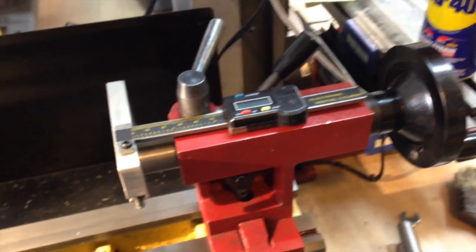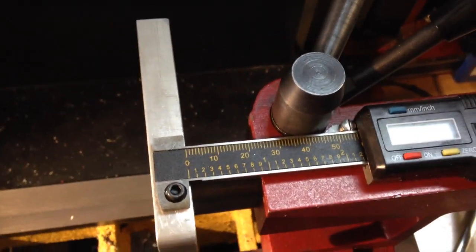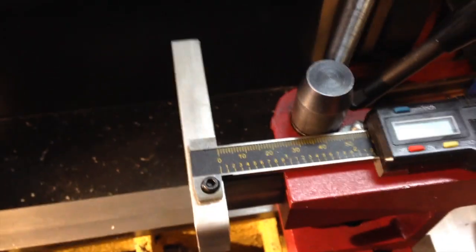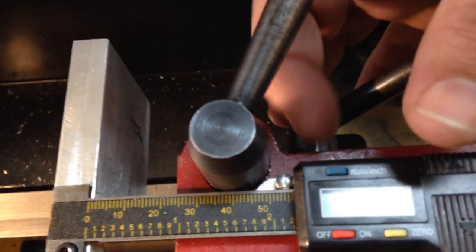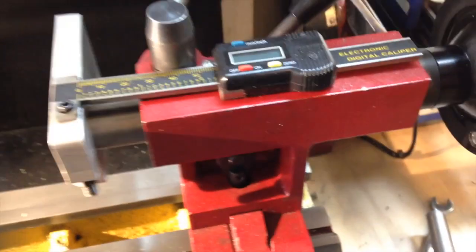So that's precisely what I did, and that's what I want to share with you — show you a little bit how the conversion turned out. Okay, so this is the four-inch digital caliper, modified quite a bit. As you can see, I have cut both of the parts — I don't know what you call that, some sort of a beak there — and ground and drilled a hole there and tapped it into the head of the tailstock.